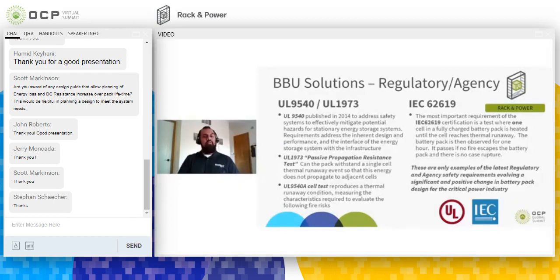There are many regulations around the world tied to batteries. In the past it was typically UL2054 and IEC62133, but now as new applications employ lithium batteries, many new standards are starting to appear that are specific to those applications. One common new test is the thermal runaway test: it artificially puts one lithium-ion cell into thermal runaway and verifies that the complete pack doesn't go into thermal runaway and that fire doesn't escape the case — ensuring that if a cell fails, it fails safe and doesn't take out the whole battery.